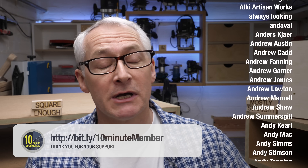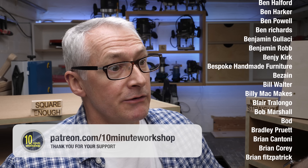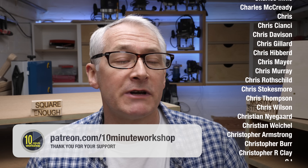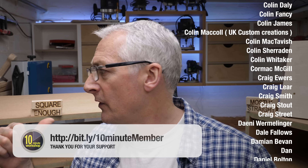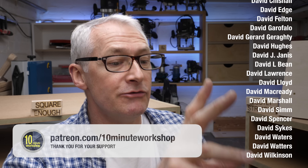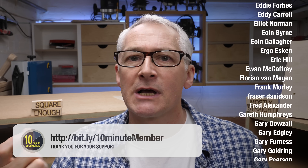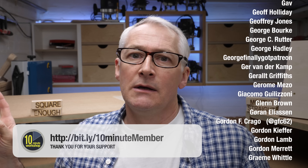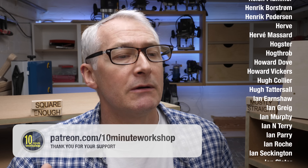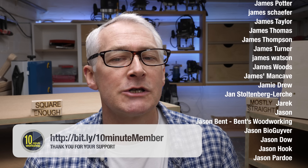I don't know what the price of the Lamello is now — somebody said it's around about 1500 quid. Certainly the connectors are around about 70 pence each, and there are 30 in this carcass, so over 20 pounds worth of connectors alone. With the peanut system, the Peanut2 mini jig, dedicated router, and plywood jig, I put a price on that of around 300 pounds, and the connectors themselves are around 15 pence each — so about five pounds worth of connectors for this one. It's not just the initial purchase price you've got to look at, but also the price of the consumables, and I think the Peanut2 really scores on that front.